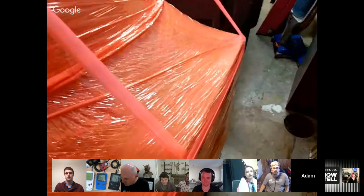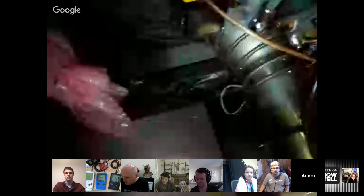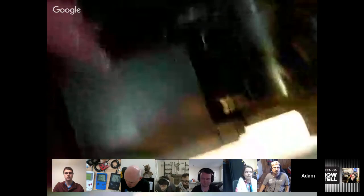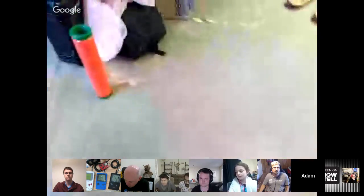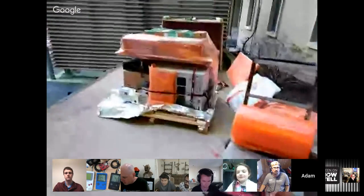Let's see if we can do this. The vacuum system on this one's kind of cool, but I don't know if there's gonna be enough light for my camera to work. Maybe. Oh, the cables are all in the way. But what's really interesting about this one is it's one of the first that has these really miniaturized high voltage supplies. That's the entire 30 kV supply that used to take up like 50 or 60 pounds in older instruments, and on this generation, this was the first one that was only like a 10-pound box that was just potted and made it work perfectly.